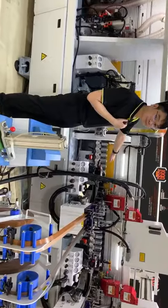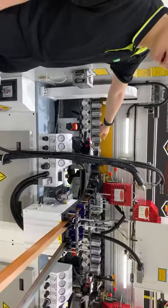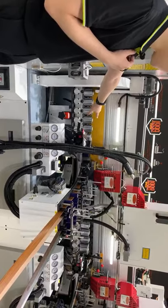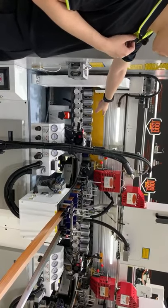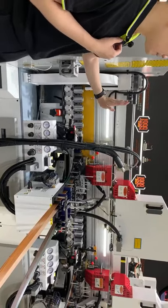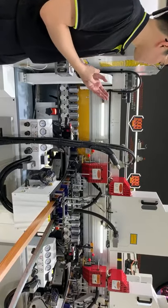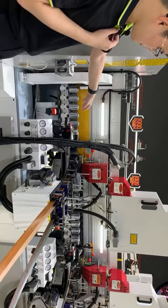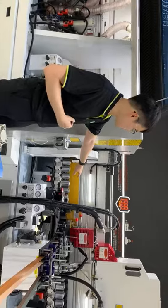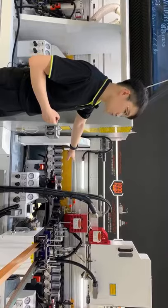At the glue roller, we use one big glue roller plus six small glue rollers. The glue roller has a slight angle — around three degrees — for better adhesion on the workpiece. This provides better bonding results between the edge tapes and the workpiece. The one big glue roller together with the small glue rollers provides enough contact area for edge banding.